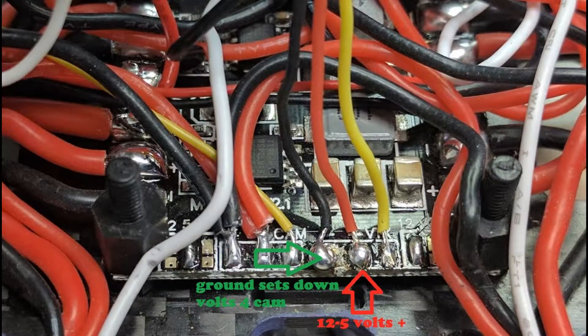There are a million other people that will tell you about that part. But you can use the same wiring harness from the original VTX, keeping track of where each wire goes. Because the color code on the aftermarket VTX going from top to bottom is: black, white, yellow, black, red. But the Wizard stock color code would be: red, black, black, red, yellow, white. There's a little bit of a difference.